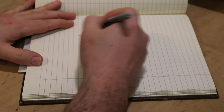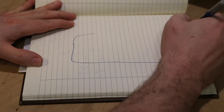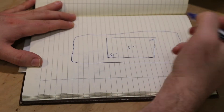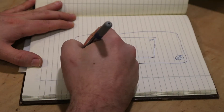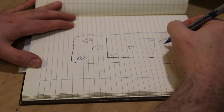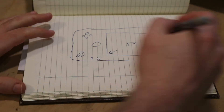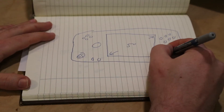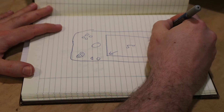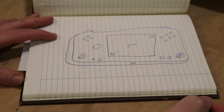What will it look like? I want to do Game Boy Advance or that old fat Sega Genesis style. The display I plan to use is a 5-inch LCD, stereo speaker system, a D-pad, below the D-pad an analog joystick, six action buttons to handle the different systems, start and select, a dedicated hotkey button, a button for rewind functionality, triggers left and right, and USB for charging and copying ROMs.